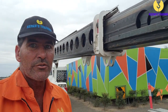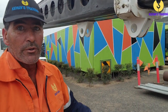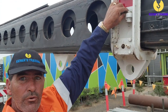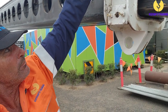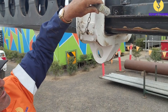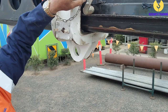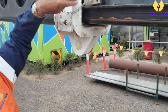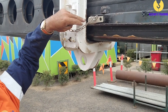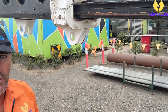The first thing we want to do is push the boom all the way out — extend the boom out to the maximum reach. Once we've done that, we can come back here and pull this little pin out and place it into this little hole in the bar. Make sure you have the handle facing away from here, because as it comes in that's going to hold that manual extension out.